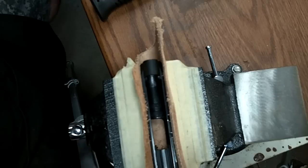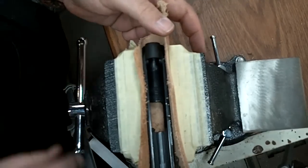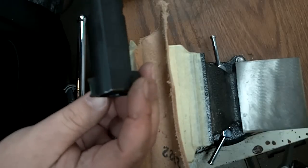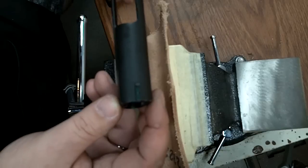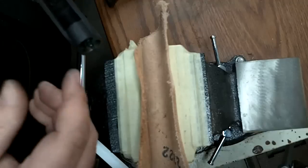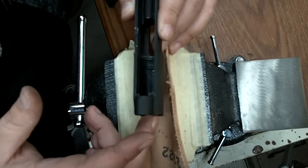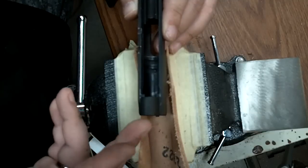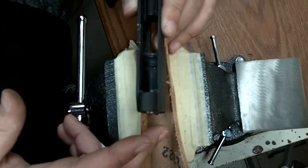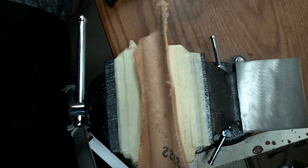That's really it, guys. What it's going to end up looking like when it's done — just like that. Now you have a nice fiber optic green front sight on this little officer-size 1911. The other thing you want to make sure you do is after you're done swaging and peening it, take a Dremel tool and grind anything hanging down that would get hung up on the barrel or barrel bushing on a full-size gun. Make sure everything fits, so you'll grind just a little bit — not a whole lot — just enough to make sure everything fits the way it should. And that's it — GunTortureTest.com, and we'll see you later.